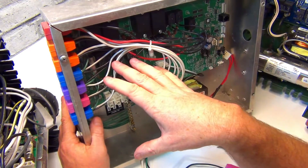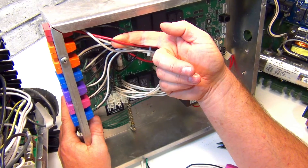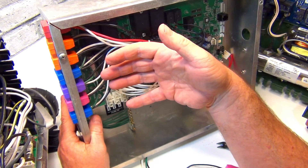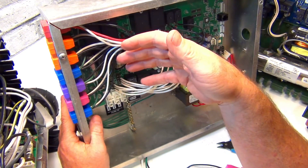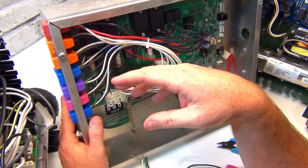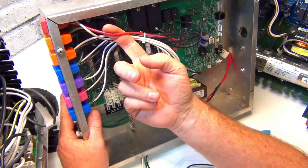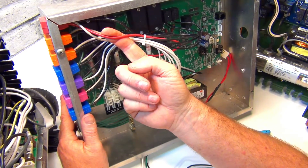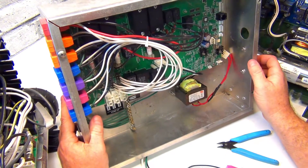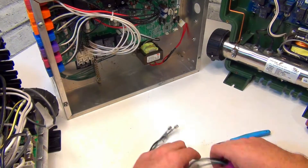If you hit the button, it's on, but you get zero amps, there's a problem with the pump. It could be the wiring, windings, or most likely a capacitor. It's usually a capacitor issue, or if the pump seal has been leaking and spraying back, the windings can go. We have a video on testing your capacitor linked below.